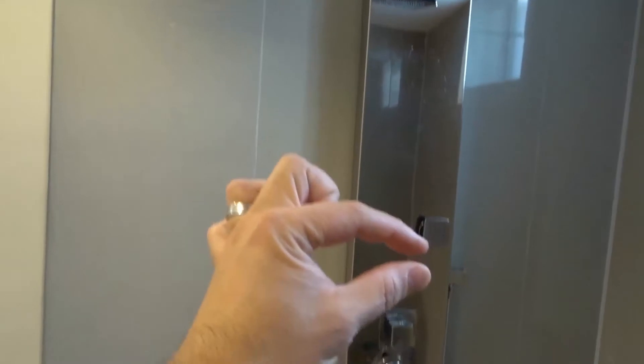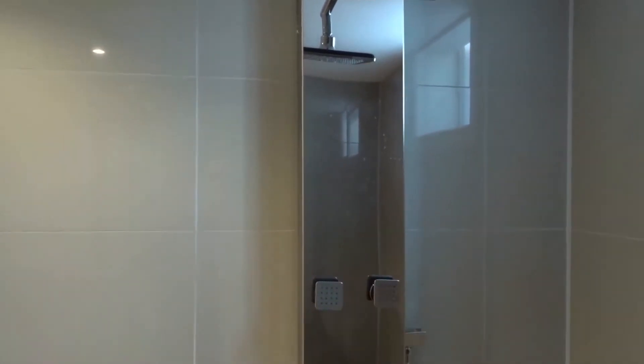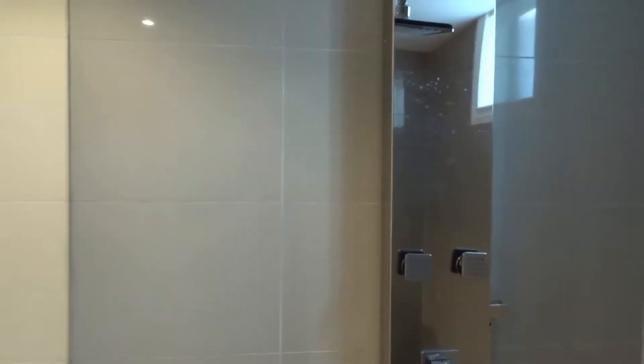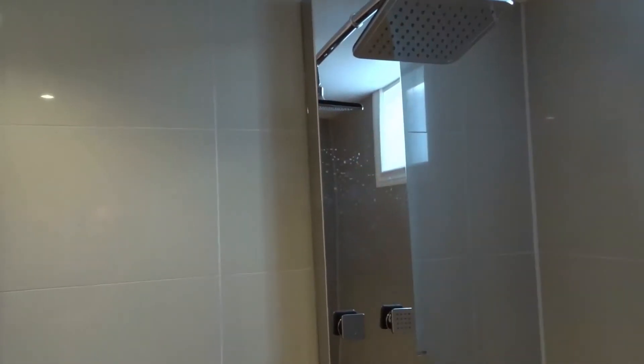Take a look right here — we have this shower panel. It's secure and it's on the wall. There's only a little hole behind it for the supply lines to come through. But I wanted to caulk it with silicone caulking anyway because it's sitting on hooks, so it can technically shift left and right. I figured I might as well caulk it with some silicone so that it doesn't move and it's watertight. As you can see, I put the bead of caulking all along either side from top to bottom.